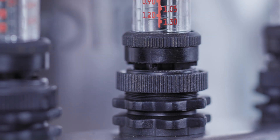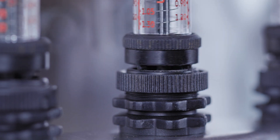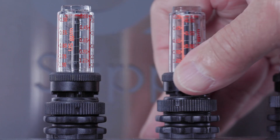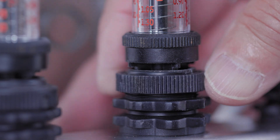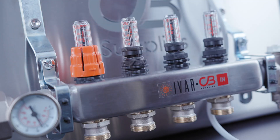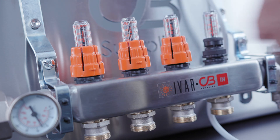If the calibrating nut is turned clockwise, the flow rate will decrease. If it is turned counterclockwise, the flow rate will increase. Once you have calibrated to the necessary flow rate, turn the bottom ring counterclockwise to lock the mechanism to set the flow rate point. You can now reinstall the orange grab rings. You will then be able to close the flow totally, and when you reopen the flow, it will return to its initial set point.